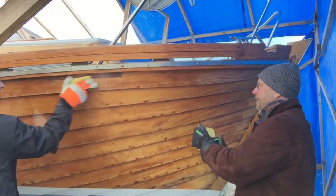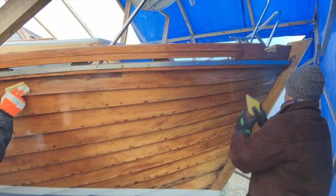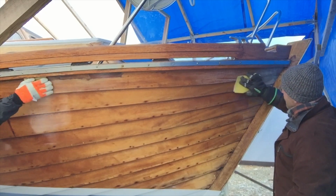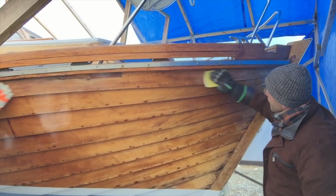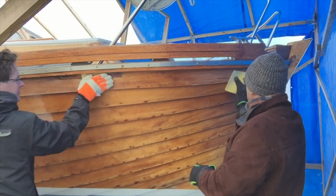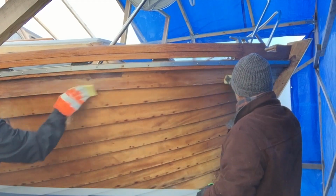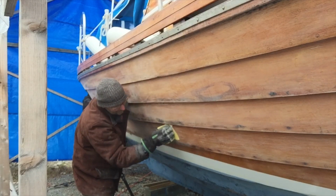The only thing is that neither me or Johan has ever owned a boat before, nevermind prepared one for the summer. Which is obvious when you look at the first footage. Oh, it's painful, but I can see myself grinding it sometimes in circles, which is wrong. We are supposed to grind it with the wood fibers. Otherwise, if you're unlucky, the scratched circles can be seen under the new coated layer. But we figured that one out fast.